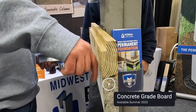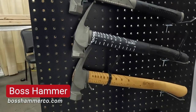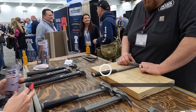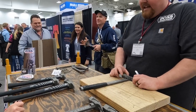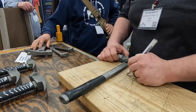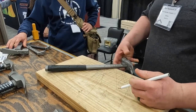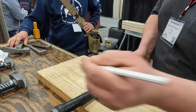There are stainless rivets every so often and then it's poured together. Our hammers go from $65 for our cheapest model up to our Pro Plus Series right here at $259.95. Our hammer will drive a nail and pull a nail just as good as a Stiletto or Martinez or anybody else in the market — but nobody else can do this. That's a 90-degree angle all the way across a 2x12. If I mark right here, that's an inch and a half wide — there's my stud pocket for my layout. This is 16 inches end to end, so if I buck that up against that line and mark it, there's my 16-inch center mark. You can use the angle cuts, pivot off your claw for a 35-degree angle. There's a quick reference stick wheel right here off this shoulder out to 5 inches, so if I want a 2¼-inch rip real quick without pulling my tape measure out, there's 2¼ inches.